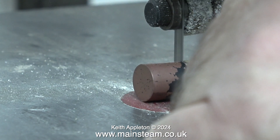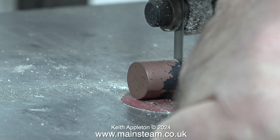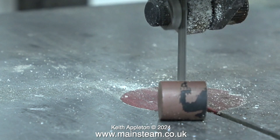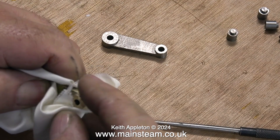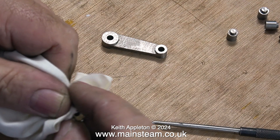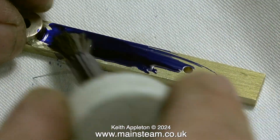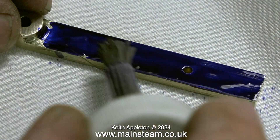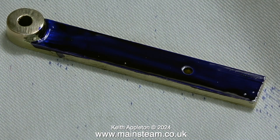Unfortunately the camera moved so I didn't get that shot very well. I don't need the boss to fit into the chuck anymore so I can chop it off using my old Burgess bandsaw. After rounding the end of the piece of bar I'm generally cleaning it up on the one-inch belt sander, followed by various grades of wet-and-dry sandpaper and a quick touch on the polishing spindle. The lever's not the right shape though — it needs to be tapered with a bit of a bulge in the middle where the hole is. I'm applying quite a lot of marking-out blue.